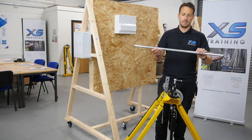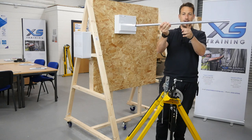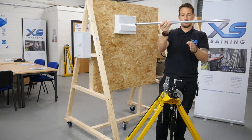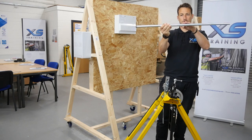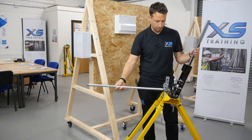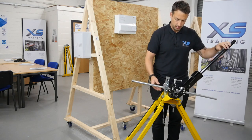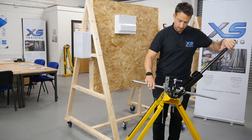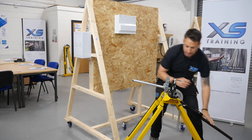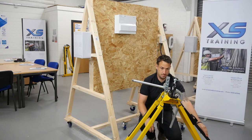So when we put a 90 degree bend in, wherever your line is, that will be the back of the bend. So as that piece of tube comes down, that line we've got there will be the back of the tube - from wall to roof. So we put a marker in there, pull your lever up, and set your mark on the back of the former. The stop's got it in place.